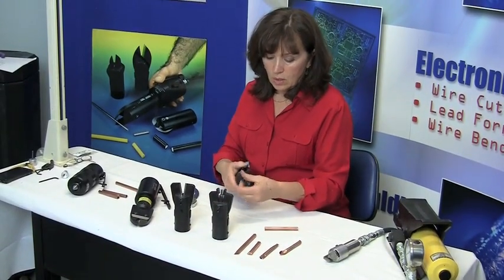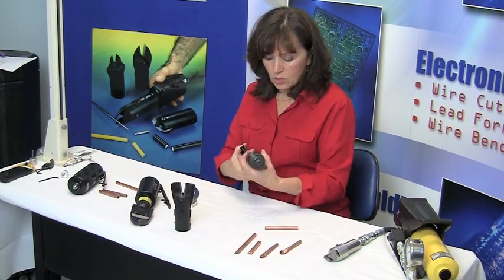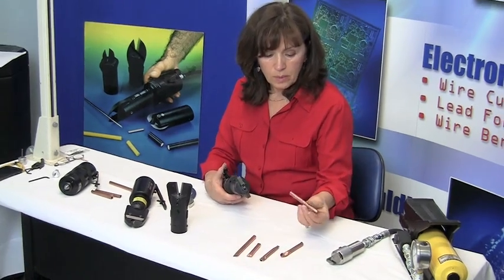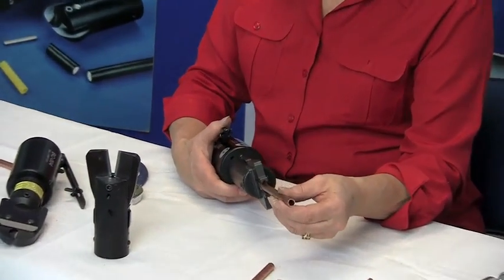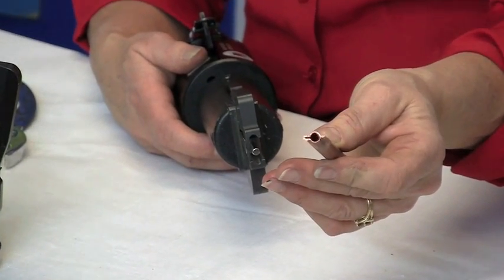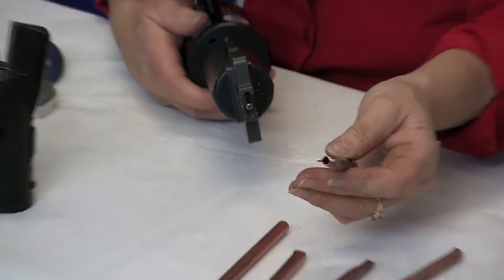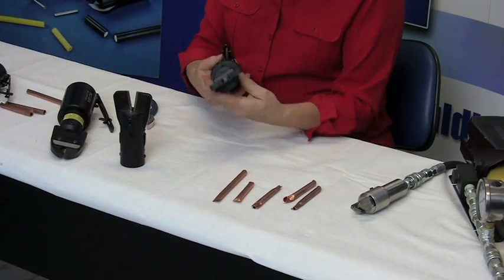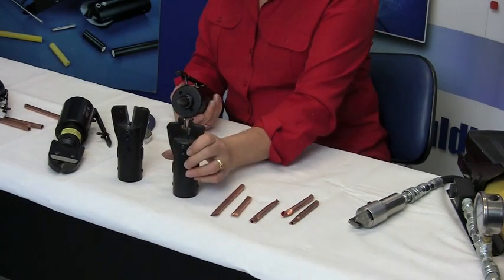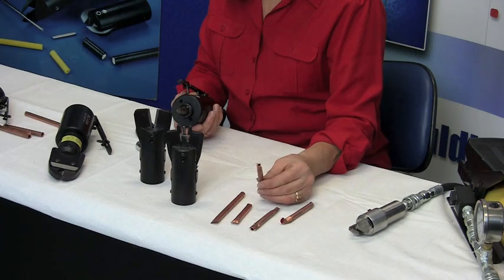What I'm going to show you is the flattening tool adapted to our SP-004 power pack. It crimps over a pilot so it reduces the opening of the tubing. This is usually for air conditioning or refrigeration, and we do a variety of different sizes and different reductions on the tubing as well.